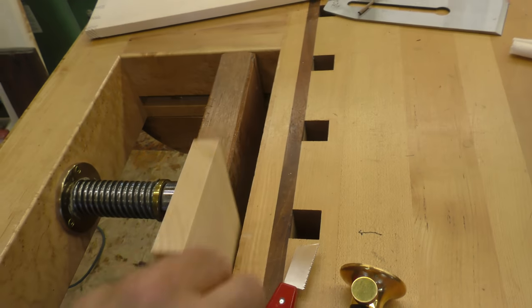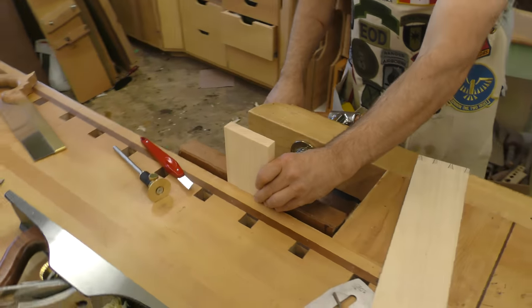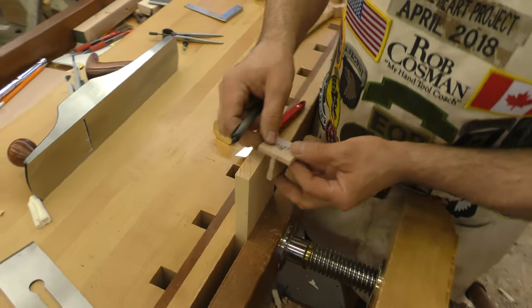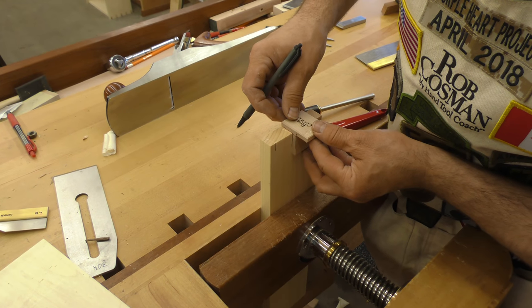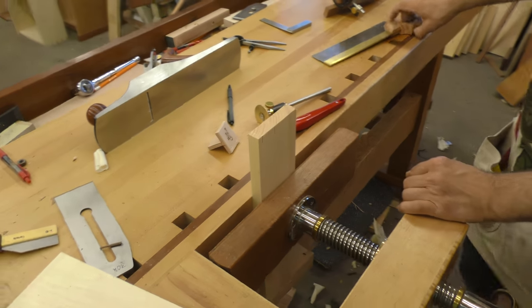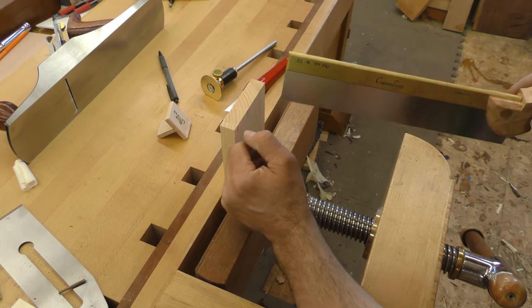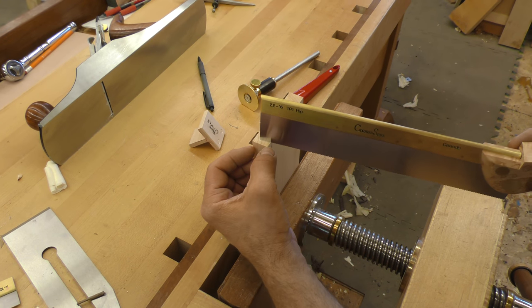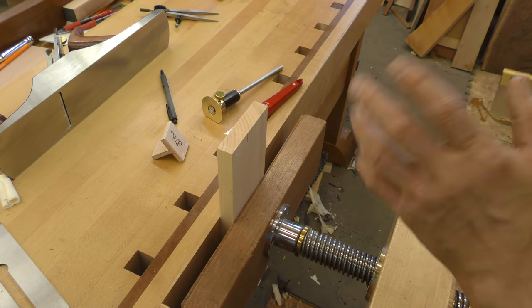If we were to turn that over, I have to have it facing me. Make sure it's standing plumb in the vise. Grab my drawer dovetail marker, and I'm going to use the square side to transfer lines, more or less as a guide. Here's the problem: in the process of trying to saw these, I wasn't able to come right out to here. The saw kerf from the sawtooth blade stops shy of there. That makes it kind of tough to get that to line up into the saw blade — it's actually a bit of guesswork, so much so that I don't like doing that.